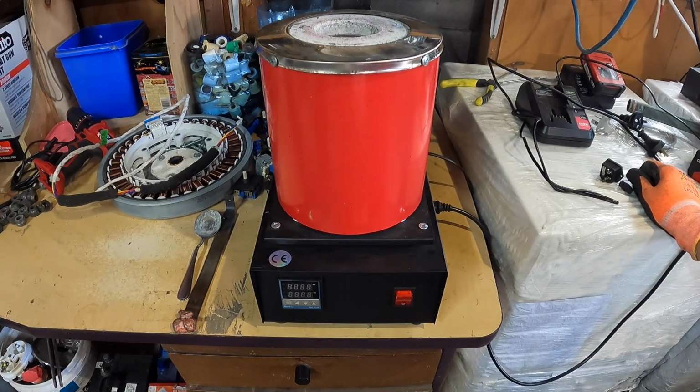Yeah, and I did it the first time I used it, got it up to temperature. I did it gradually, not straight up to 1085, which is what copper melts at, and I usually have it sitting at 1130ish. The top temp is 1150, as I'll show you later on. I warmed the crucibles up and broke the crucible in, the one it came with, and no problem at all. So when I started to use it officially for the first time, there was a bit of an issue that happened, not at that point in time, but the second time I went to use it.